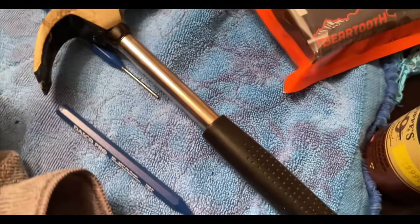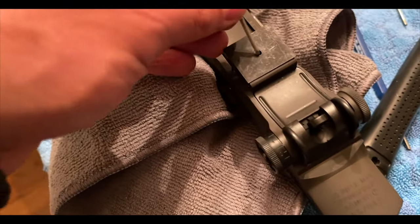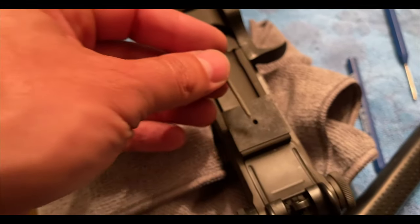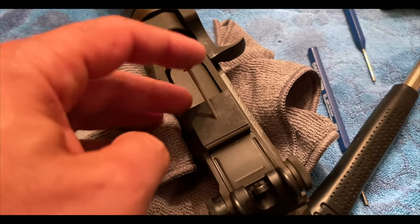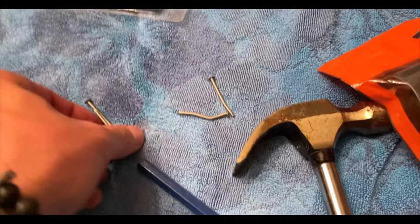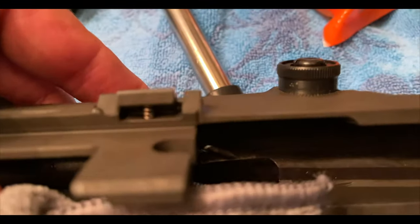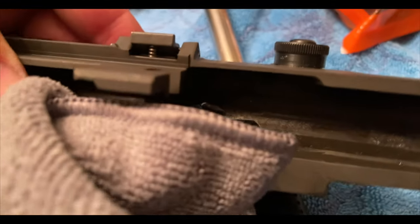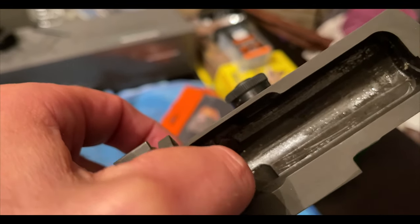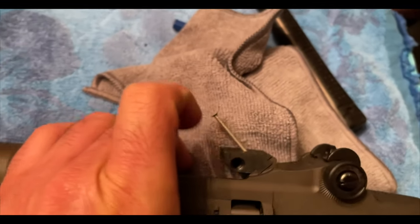You can take a nail with a smaller diameter — before you bother with the pin — because if this isn't perfectly lined up you're literally going to be hammering the pin on the bottom part of the receiver and bend it. So what I'm doing is taking this nail and seeing if it goes through to make sure I'm lined up. Sure enough, it's going through. So now I know I'm in good shape — I can literally push that nail out with my thumb.